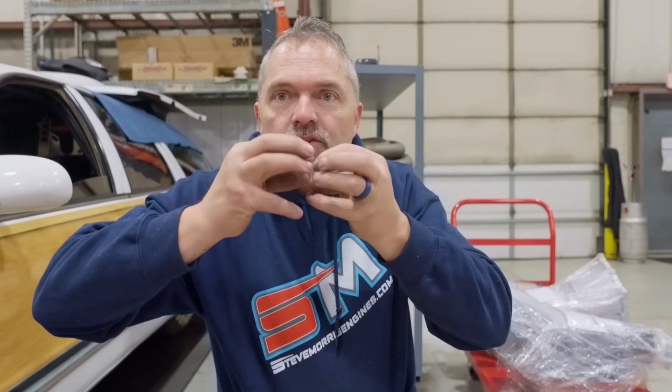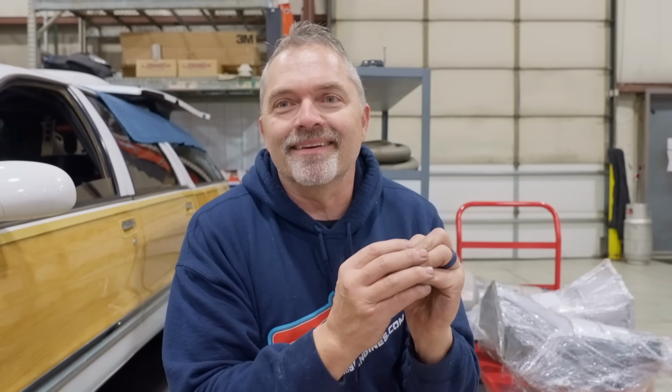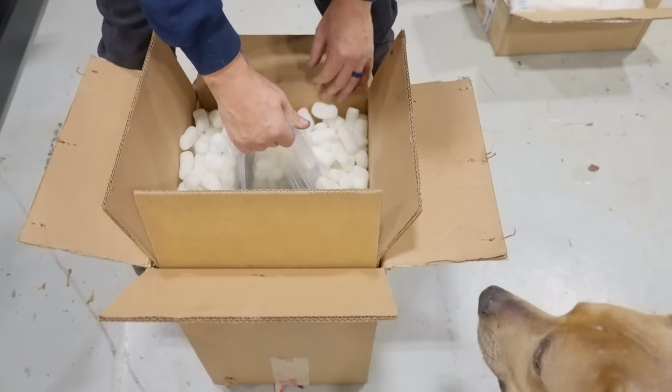What are the rotors really doing in there? That's what we're talking about. This is going to take up that clearance, and at the same time, it will wipe off because the rotors are going by each other. So it would just wipe off anything that's excess and leave anything that wasn't excess. It's not about measuring it. It's not about EDM cutting it. That's all stuff where we're building a CAD program and making it, and it's going to be this. Well, guess what? It doesn't end up that way when it's running. Same thing with turbos. So running condition, that's what this thing is all about.